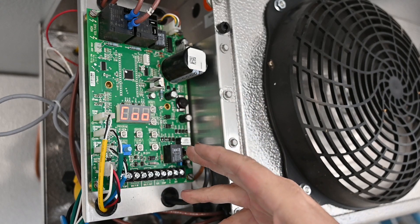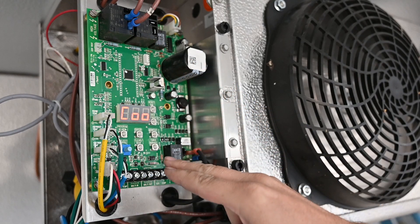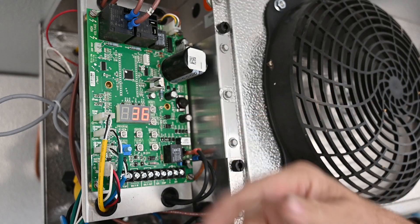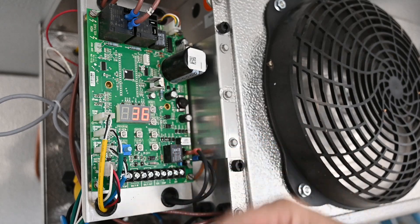This just does many other things as well, just like a residential unit would — such as it's going to control our fans, it's got timers for on/off cycle, and we have alarms. So if our temperature gets too low, the alarm will sound, and if our temperature gets too high, the alarm will sound.